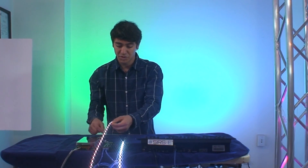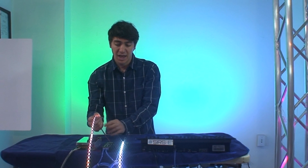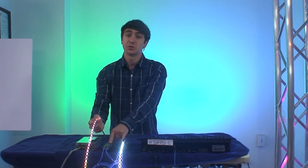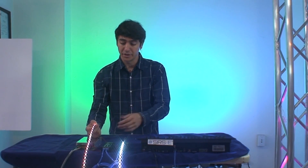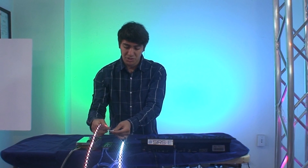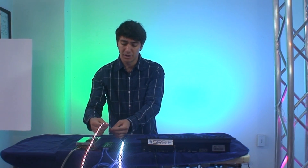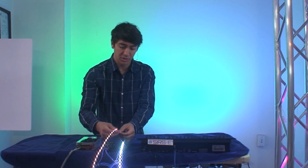At the end of the strip you are going to add another lead going into the same strip. These two LED Contour 2's must be on the same DMX address, because if they are not on the same address you are going to throw off the whole thing and not get what you are trying to do. Right now I am using a clip-on connector — usually these work okay, but it is best to always solder all your leads. Just for the sake of showing you, I am going to do it like this.